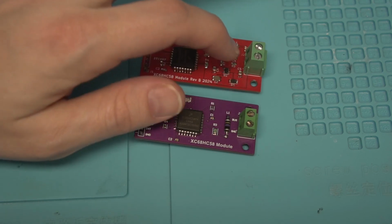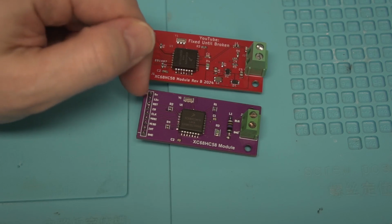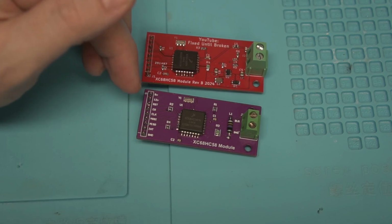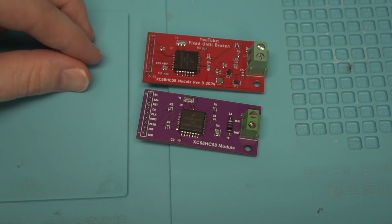And then I put a 14-volt boost power supply. So you only supply it with 5 volts. The old one you needed 5 volts and 12 volts. This time you just need 5. The pin that was used for 12 volts doesn't go anywhere anymore. So that is just a blank pin on there.